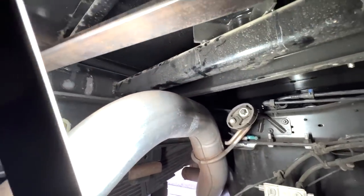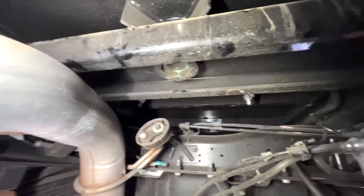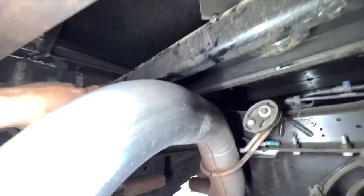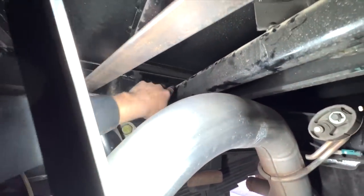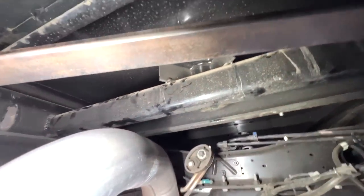Get this out of the way so you can see what we're working with. They've got a piece of quarter-inch — might be 5/16ths — put through a brake, made a nice little holster for the B&W turnover ball, welded to the top. I welded around the ball on the bottom here, around the ball socket. But what they did on the sides — they only welded the top piece to the C-channel on the wall. So what I did is weld the bottom piece and on the insides of both sides. So much more structure added there by adding welds they should have done from the factory.